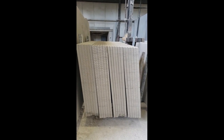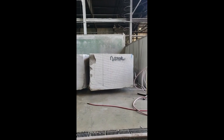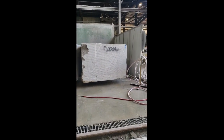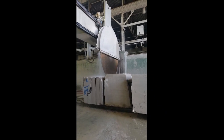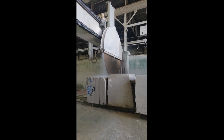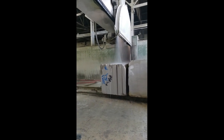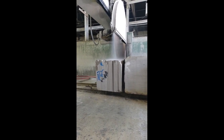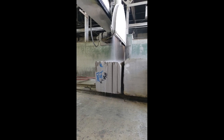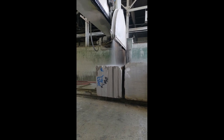Hey, Steve. Basic architect here. If you're ever wondering how they make slabs like that out of blocks like that, it's using saws like that. That's about a seven-foot diameter blade. You can see there it just made one pass — the short one that the water is spilling out of. It's probably about seven inches deep in that cut.